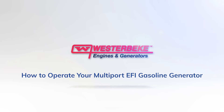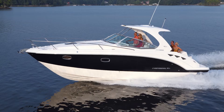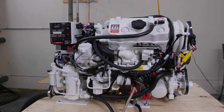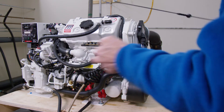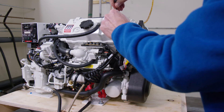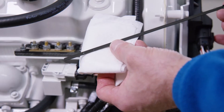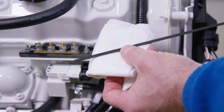The first thing we'll cover is the initial startup of your generator. Before starting your generator for the first time, or after a long period of inactivity, be sure to check the engine oil level. Check the oil level with the engine cold — it is best to let the engine sit unused for a period of time before checking. Remove the stick and wipe it clean, insert it all the way in, then remove it and view the actual level. The two marks represent full and one quart low; the level is best maintained between the two marks. If needed, add oil to maintain the level at the full mark on the dipstick.